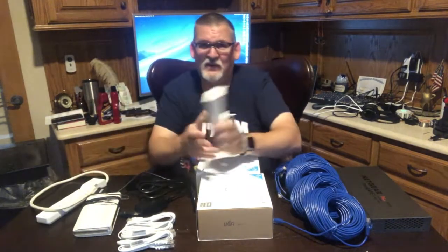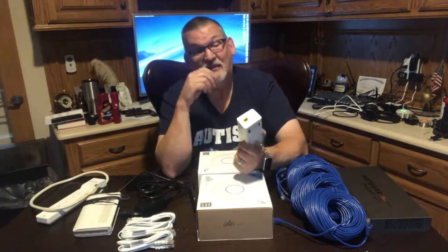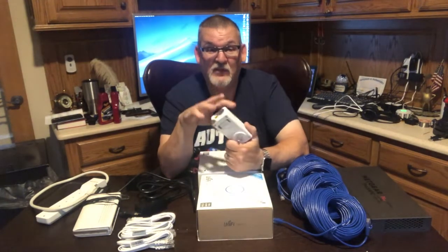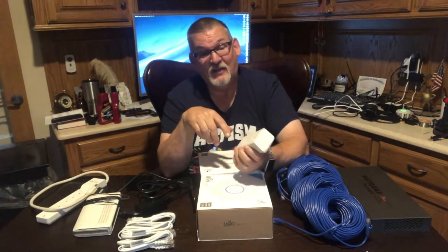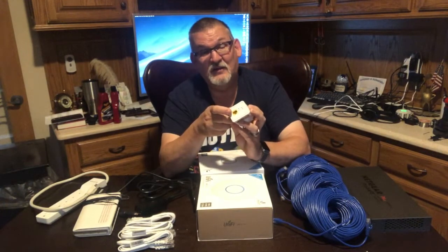Now, one thing I've noticed about these is that they usually come in a pair. One of them, you put it in the outlet nearest to your router, and then you connect the Ethernet on that extender to your router, and then the second one you plug into another place throughout your house. Really, any outlet, as long as it's in the same breaker box. Doesn't have to be the same circuit, or the same breaker, but it has to be in the same breaker box.